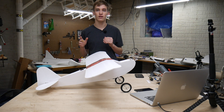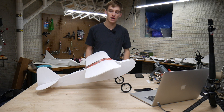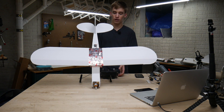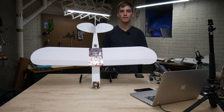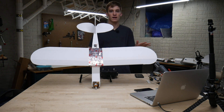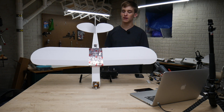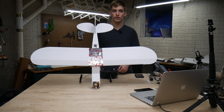If you have any questions about servos and linkages — I know that's kind of glossed over in some Flight Test material — go ahead and comment down below. Now as you can see this plane is a four-channel design, so I went ahead and added the ailerons, and I recommend you guys do the same if you're a beginner. My reasoning is that the bank and yank flying system is really essential to have in your muscle memory when you're flying. Most of my planes like the FT Viggen, the Aero, or the Bloody Baron are pretty much all bank and yank, so once you get that down you can fly pretty much anything. I'd recommend adding the ailerons even if you don't use them — you can program them out, but it's a nice thing just to future proof your plane.